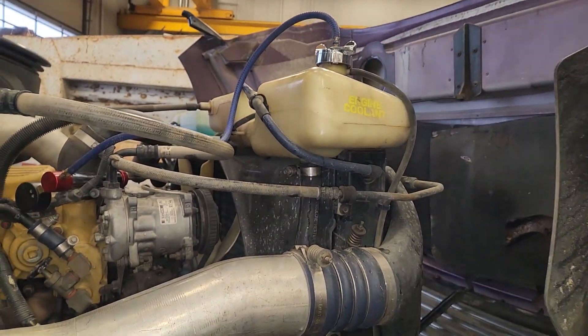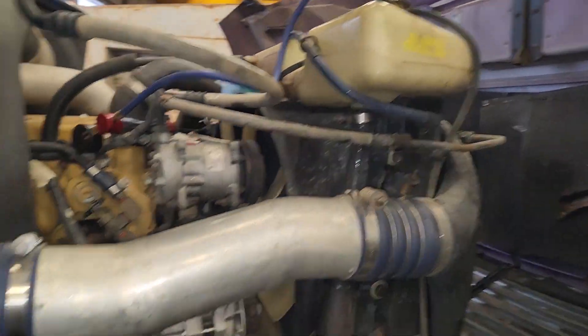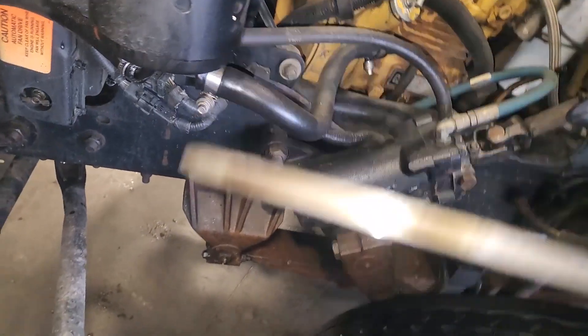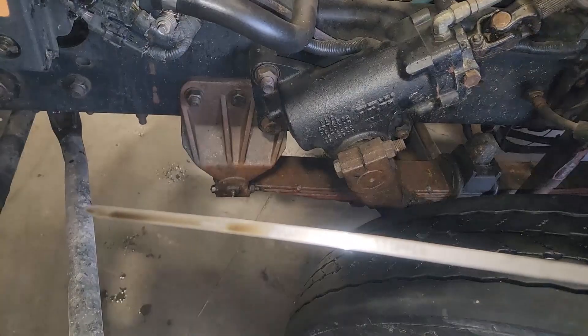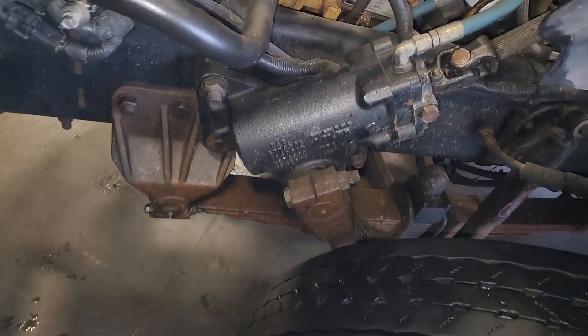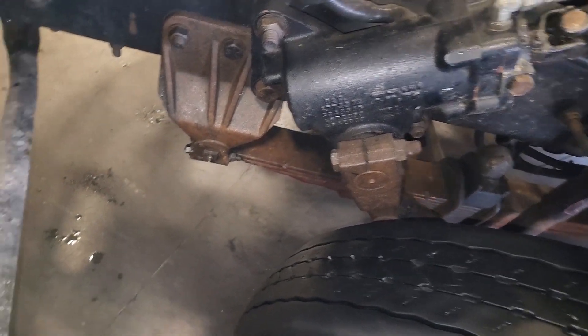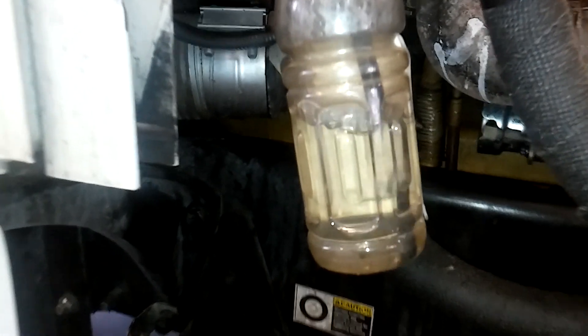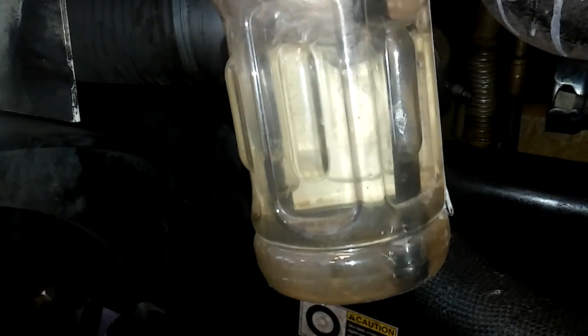So we found them. Now, what if your coolant level's dropping but there's no coolant on the ground? Well, it can be going a couple places. One would be in your crankcase - check your oil, check your dipstick. If there's rust and signs of moisture on that, you might have a problem; you want to pull your oil pan and look for signs of coolant. If there's no rust on the dipstick and nothing on the ground but you're losing coolant, you might want to do something called a bottle or bubble test - basically looking for combustion gases in your cooling system. I have a separate video on that. But basically, if your overflow vent tube looks like this when the engine's running, you probably have a blown head gasket.